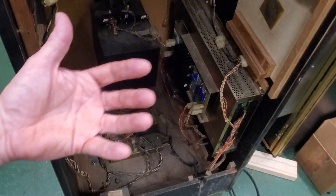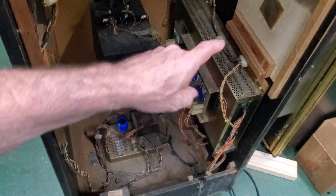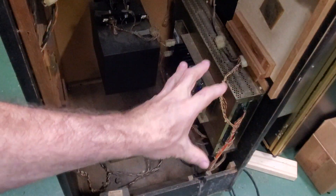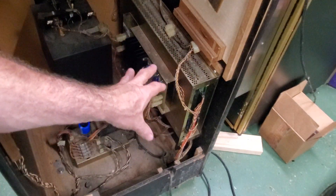Normally I like to do this a little bit at a time, but in this case I just steamrolled through it — I didn't even check the stuff, just started putting everything together. I've replaced every capacitor on all three of the system boards, every single board in there, and I replaced some of the voltage regulators and all of the wear parts. You can get a rebuild kit — I got mine from Arcade Shop. There are plenty out there, and Bob Roberts, or his family, may still be selling parts as well.